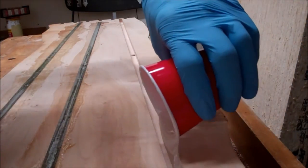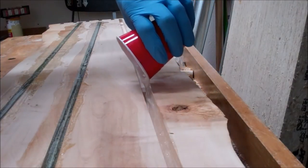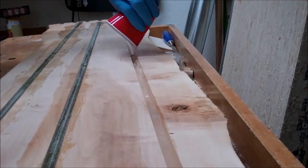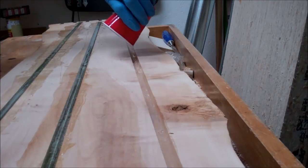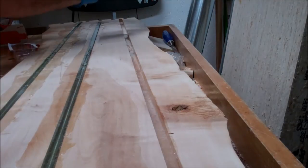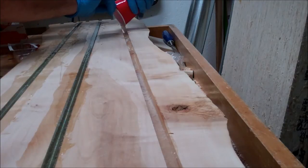I could be moving much faster and get away with much less. Because the threaded rod takes up much of the volume of the slot, by filling it a little bit past the halfway point, I'm really overfilling it. The goal here is to get enough so that once you put the threaded rod down into the epoxy, the bottom of the threaded rod is sitting in epoxy — we don't want any air gaps to remain underneath the bottom of the threaded rod.